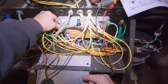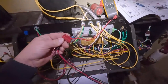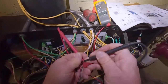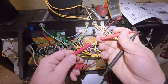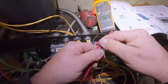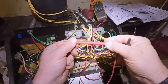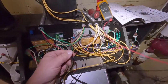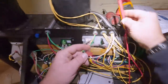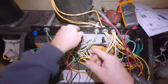We can unplug this here — I thought this controller might be going bad. It still says network FLC standby. We can come over to our meter — the voltage didn't tell us what we needed, but we can go between these two terminals and see if we've got resistance between them. 0.7 ohms... 0.1 ohms. I added some dielectric grease to my connections inside the meter — holy crap, it made a huge difference. 0.1 ohms, that's unheard of. These are Probe Master leads — American-made. Joe Shearer gave me these at the Florida show, and these things are awesome. You've got to modify them a little bit with this weird finger protector, but I've had them since March — nine months of being wound around, which you aren't supposed to really do.